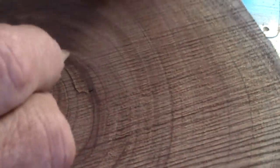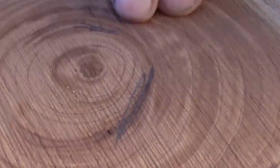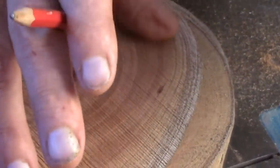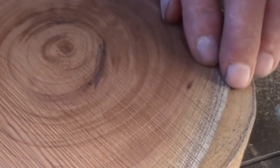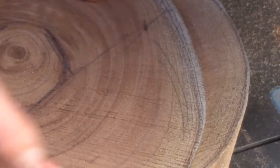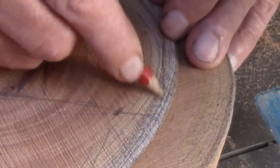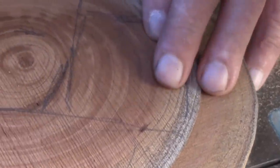So what I'm looking at here: I can get quite a bit out of this log. I don't want to go there, and I don't want to go there either. The width is relevant — the height is that much, so I can get quite a good little bowl out of anywhere across here. I've got the greatest depth there, so I'm going to cut across there to start. My bowl will be sitting somewhere in there, and that's going to leave a square piece for some little end grain project — a box, something like that. And there's another one over here.